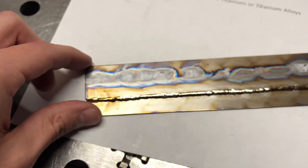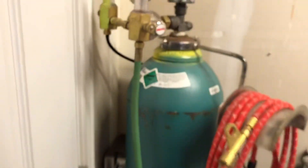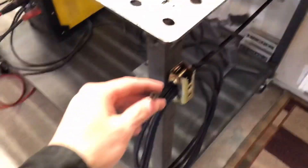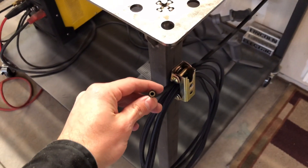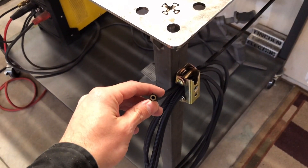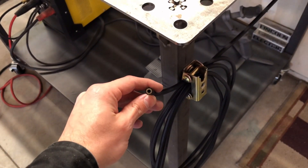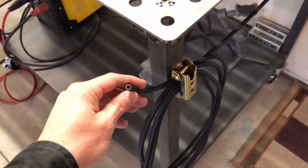You want good shielding on the top side and on the backside. What you need to get is a dual flow meter setup like this, where you have your argon going to your machine. You see this black hose here — this goes to your back purge line. I have it routed over to the other side of my weld table. I just stick this end into the tube or pipe and I can run argon and shield the backside of the weld pool. This is super important, so get yourself a dual flow meter and another hose so you can run purge.